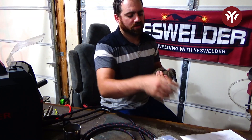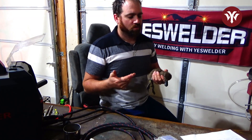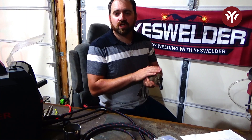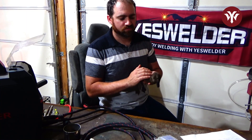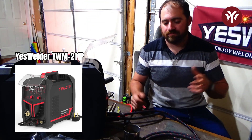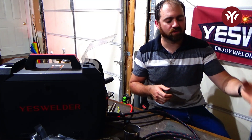I'm going to go over the benefits of each, their characteristics, and what they may be used for other than stainless. The machine I'm going to use today is the YesWelder YWM-211P — same machine I've been using in the last couple of videos. This thing is set up for a lift-TIG start; it is not high frequency. This might end up playing into the differences between all these tungstens, and I wanted to see how well they perform for a start, because lift-TIG can sometimes be a little tricky depending on what tungsten you're using.